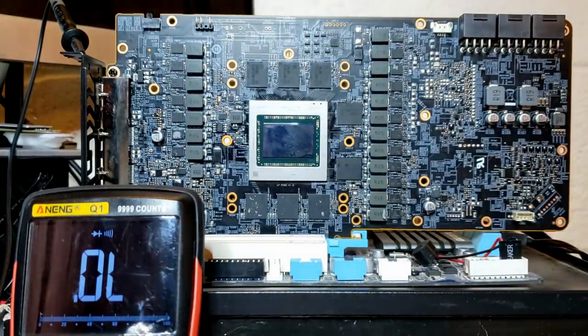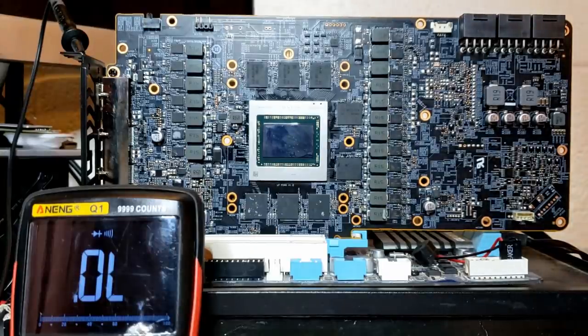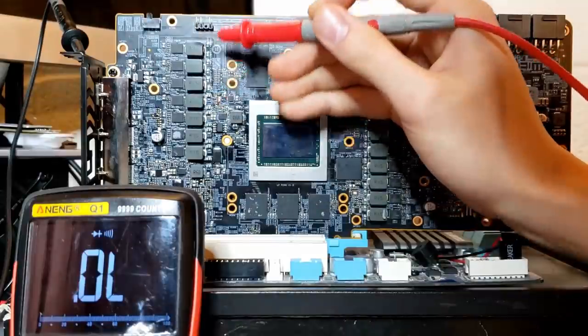Our suspects are all these rails here. Remember that when we fed 0.6 volts on the short 12-volt input, we did not have voltage appear on the SoC rail inductor - so we can also eliminate those bottom two. That leaves just five phases as suspects. We've gone from having to consider possibly 14 different GPU phases to just considering these five.